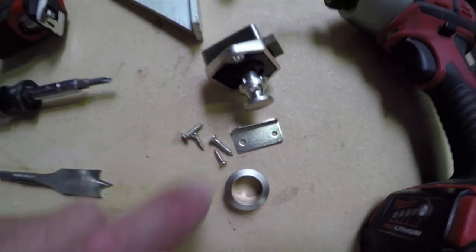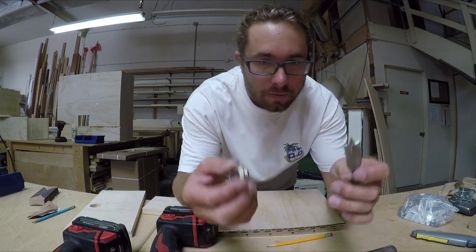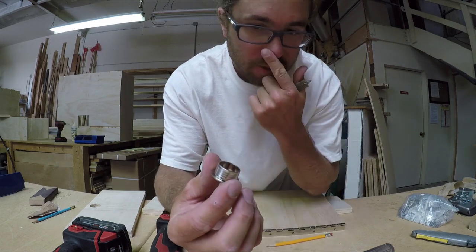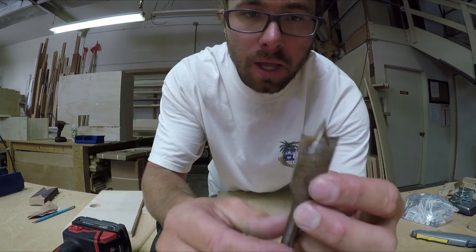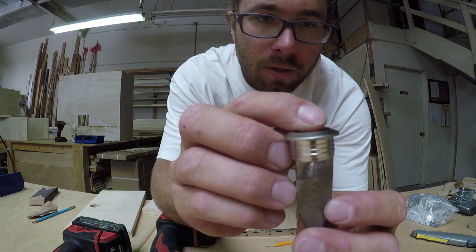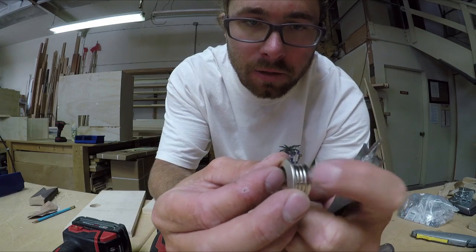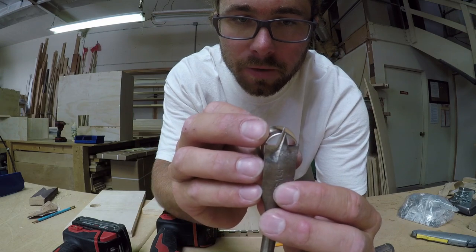To install these, obviously you're going to have the mark on your wood. But first I'm going to explain why I use spade bits and how to find the right size. Pretty much every single one of these push latches you buy is going to be this exact size, which is a three-quarter inch spade bit. You can see that by holding it up and seeing how wide it is — you want it to be the same width. It has these little ridges so that when it pushes in, it stays in and doesn't pull back out.